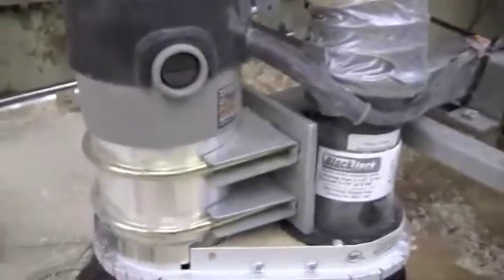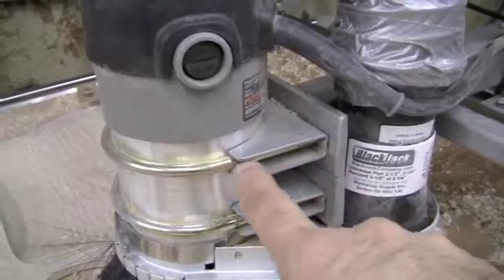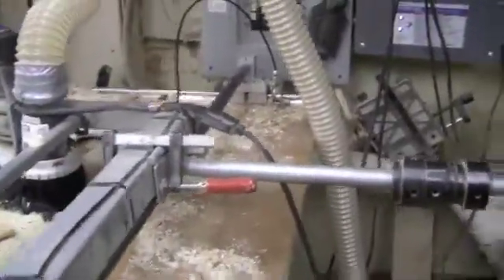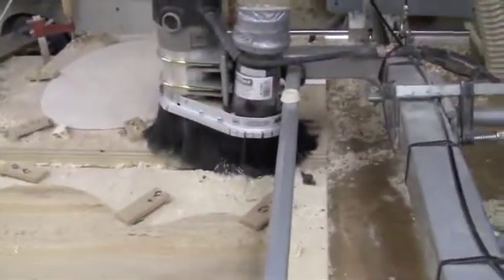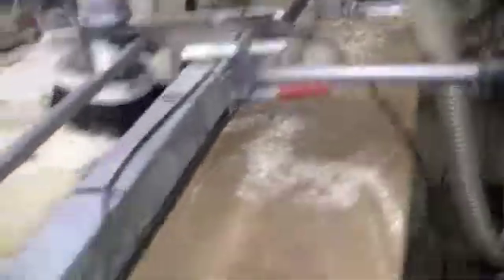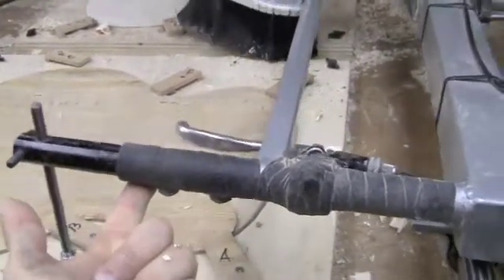You can see that the router is mounted to a metal plate on the end of that square tubular piece of steel with a couple of big U-bolts that I got at Princess Auto. On this end I've put a counterweight — the reason is I didn't want the carriage assembly as it bears down on either the template or the pattern to press down into it and distort it. This counterweight effectively balances the weight of the carriage assembly on the other side, and you can see with very light finger pressure I can raise that up and it drops down.